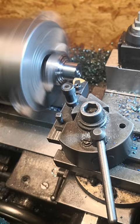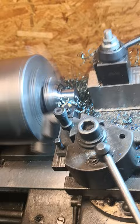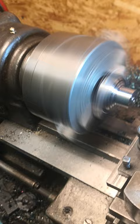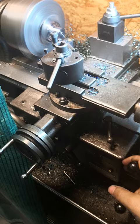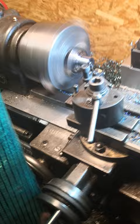That's all the magic. I travel 5.0 millimeters inside, pull the lever slowly until it locks in, and then I stop it by hand because I'm not certain it stops at the right place. Oh, it would have stopped! Well, and that is how you use the auto feed with the Schäublin 102VM: pull the lever down until it engages, like this — voilà — then it starts to move and it starts to feed.